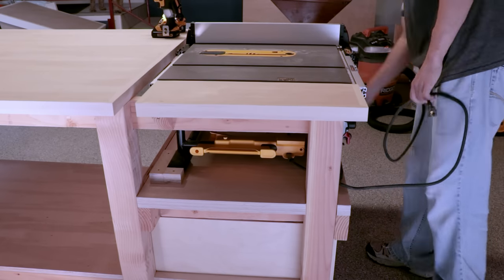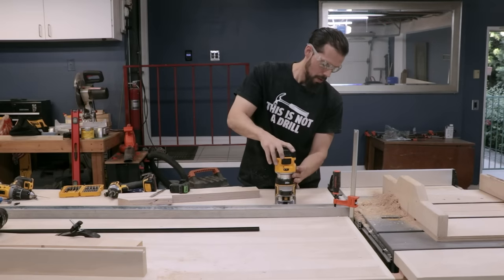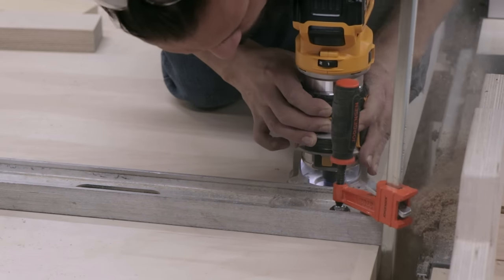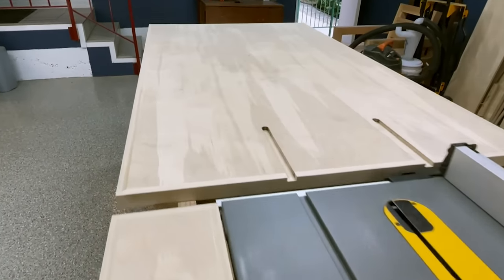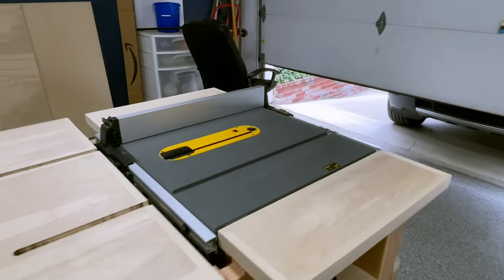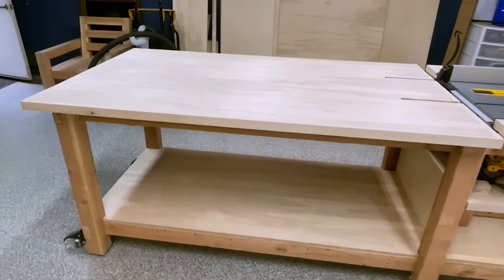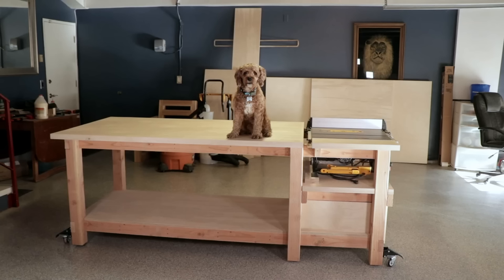Then I waited until I got my new router, and with that I put in slots that are extensions for the miter slots to use with a crosscut sled on the table saw. We lined up the slots using a straight edge and ran the router using a three-quarter-inch straight bit. And there is the finished table. Overall it was a really fun project to build and I'm pretty pleased with how it came out — I know it's going to be of great use for future projects. I don't have any finishing on the surface right now but may decide to do that later depending on how much I spill. After all, it is just a workbench. Thanks for watching — we'll have detailed plans available if you're interested in making this bench. See you guys around for the next project. Stay tuned.